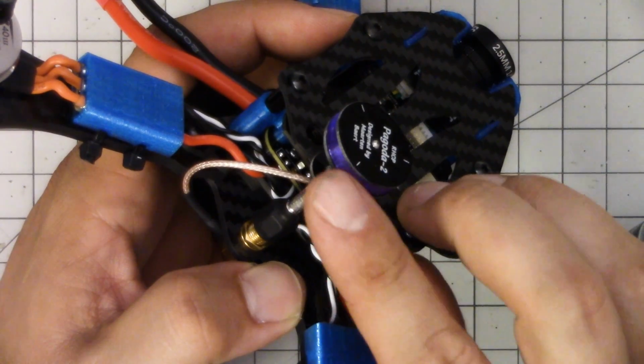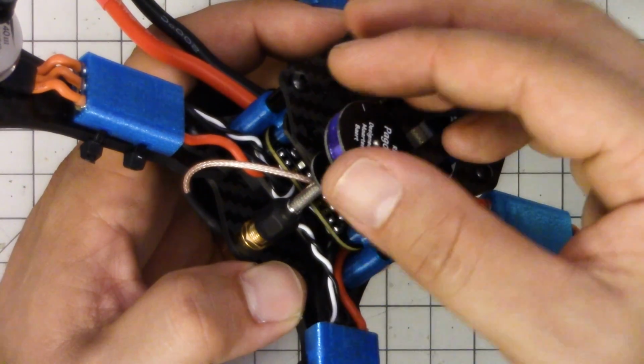The problem is that it's really hard to manufacture a Pagoda to the right tolerances. It's really easy, if the plates are not aligned exactly right, or if you've got a cover on it, that it changes the dielectric, etc., and the tuning changes and the performance goes. It's a really finicky antenna.